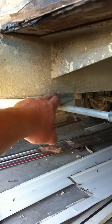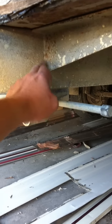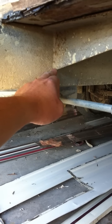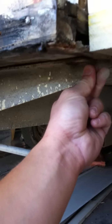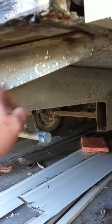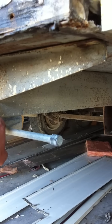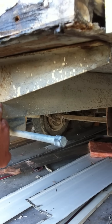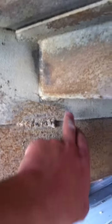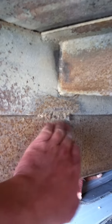The wall is actually a weak point in the beam. The lower base, where the metal bends over 90 degrees, would be a strong point. So why wouldn't you bring this down and let it end right there? As you put a force onto the end of this little piece of metal, the force will be transmitted right into the wall, which of course bends. And you can see right here where this becomes a problem — look at that stress fracture. That's exactly what I'm talking about. If this had come down all the way to the bottom edge of the beam, we wouldn't have it.